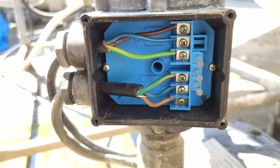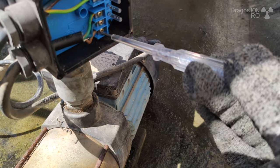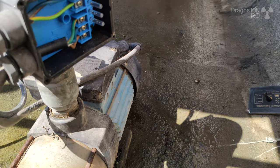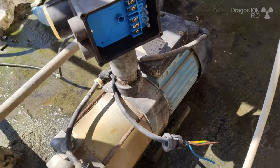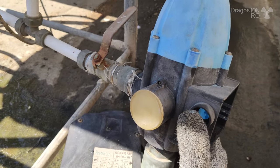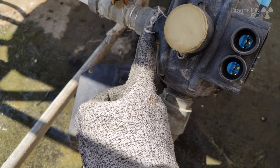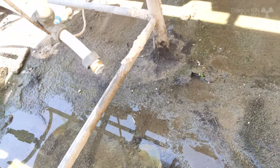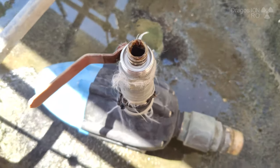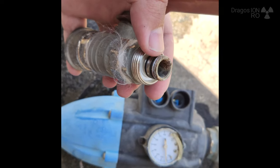This is the other automatic control, the old one. You can use an electric screwdriver - put your finger on the top of the screwdriver and touch all the live contacts. Make sure the light inside the screwdriver doesn't light up, which means there's no power. I disconnected all the wires from the old control box and all I have to do now is remove this thing. I wanted to disconnect it from there, but it just wouldn't move, so I removed the pex pipe fittings. They're pretty useful - easy to disconnect and reconnect. Finally disconnected this thing from the old control box and I'm keeping this part, even though maybe I should replace it too.